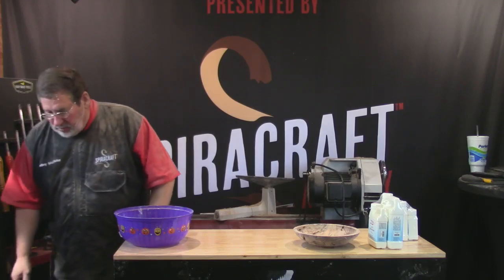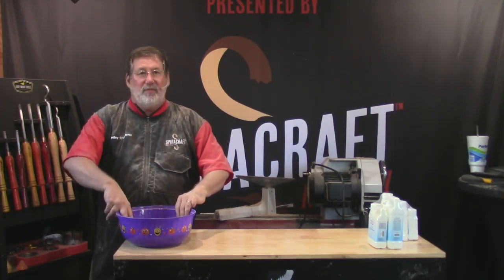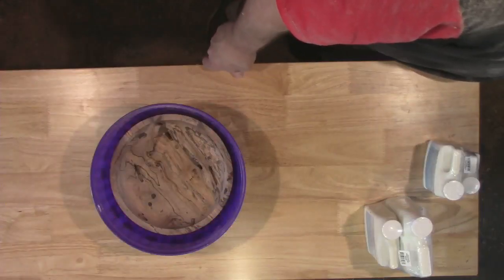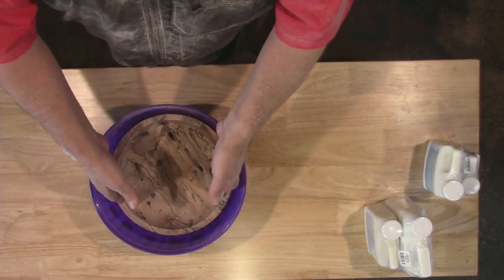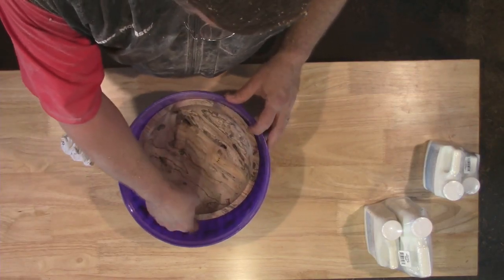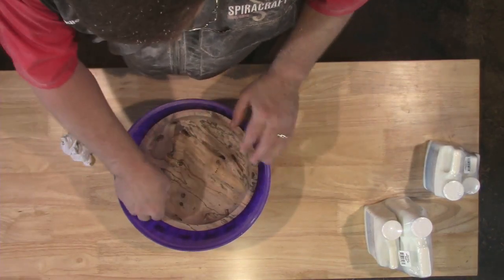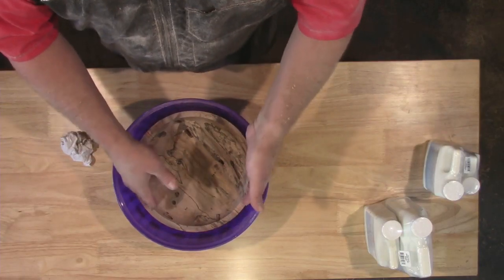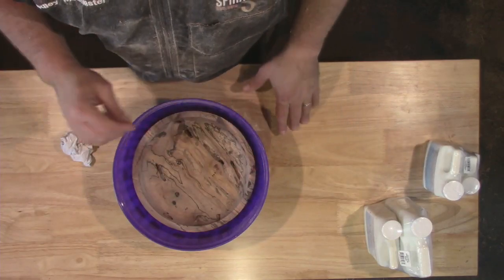Now, the bowl that I have planned, that is my casting bowl, okay? Let me take you to the overhead, and you'll see how close this fits down inside. So the amount of resin that will be waste on the inside is not dramatic. It's about a finger width, okay? I'd like a perfect fit going in there, but that's not that much to give up. So I will fill below it, let it come over the rim, and fill inside, or fill the inside and let it flow over until it's completely submerged. That's what will go in the pressure pot.